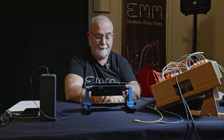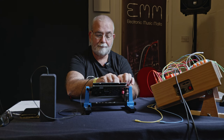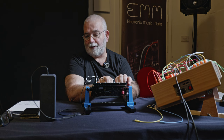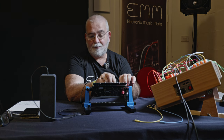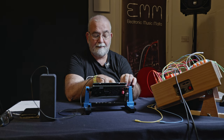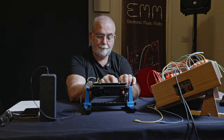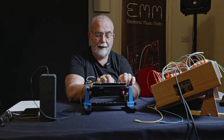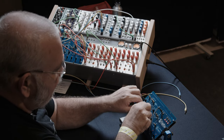Since this also gets boring, there is also a feature: this is the fundamental frequency of the oscillator. We also decided to improve it by adding a sub-octave, and another division to get a further sub-octave. Basically, what is happening here is that we are getting the fundamental frequency, dividing it by two to get a sub-octave, and dividing that further by two to get another sub-octave. So you can blend into them. Here, what I am doing is using a three-stage mixer to blend between the three separate frequencies.